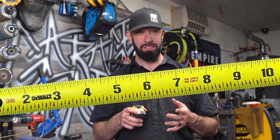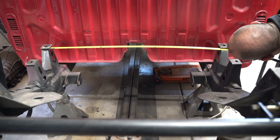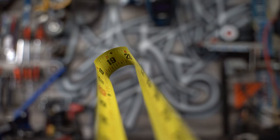I've got the center of the cross member already cut out. I just need to figure out how long to make the two sides. To make sure the notch is in the middle of the cross member, I need to find the center of the cross member's total width. I've got a cheat code for easily finding that center. GarageFab now has viewers outside of the US like India, the Philippines and Australia. Most of us in the US use the imperial measurement system — fractions of inches and feet — it's a ridiculous system that's difficult to learn, but easy to make mistakes with. So here's an easy way to find the center of any measurement without math: just fold a tape measure, line up the end of your measurement, and your answer will be dead center on the other end. My cross member will be 38 and a half inches total, so the center will be 19 and a quarter inches. Let me know in the comments if you find that useful.